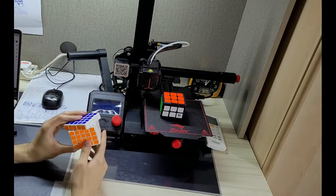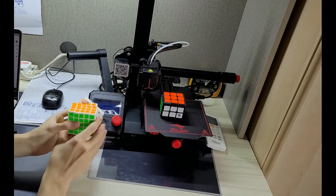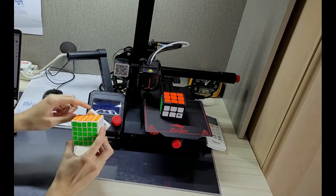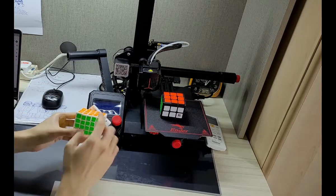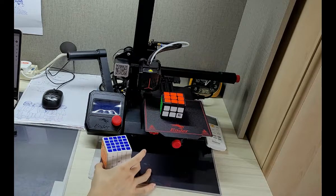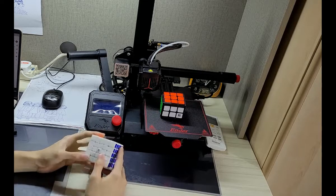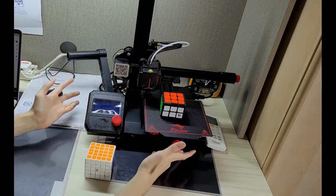The problem of requiring infills just to print the roofs of any flat pieces is also mostly overcome, because you can design your pieces hollow such that any powder trapped inside doesn't end up inside the final puzzle. You can flow it out through the holes you have put in the piece. But then the problem is SLS printing is much more expensive. It basically cost me about as much to design every part of this puzzle and order it off an SLS print website as compared to buying this entire printer as a whole.